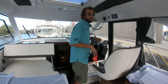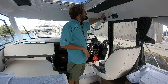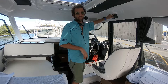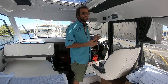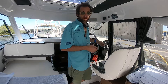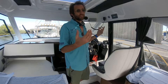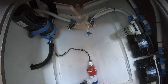Behind me you're going to see two other displays. Right here I have the Belmar, so this is where we're reading how much consumption we have from the AC unit. Here we're going to have the inverter control. This boat has the option for the 2000 watt true sine inverter, so when we're away from shore power we have air conditioning. This inverter charger also allows us to run the outlets and the microwave while disconnected from shore power.